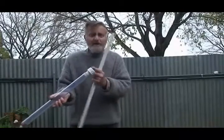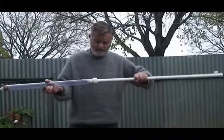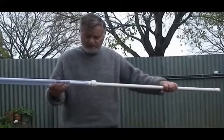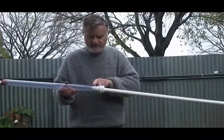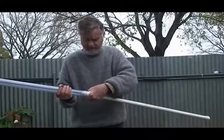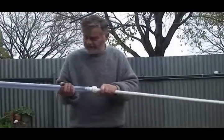There's a rubber gland in here which you should keep clean. When these instruments are delivered they're in a shortened state to make them cheaper to deliver. Before use, extend it so that the inner tube is just level with the bottom of the scale, then tighten the gland - not overly tight, just a good finger tight. Make sure that everything is clean because if dirt gets into this gland it will leak.